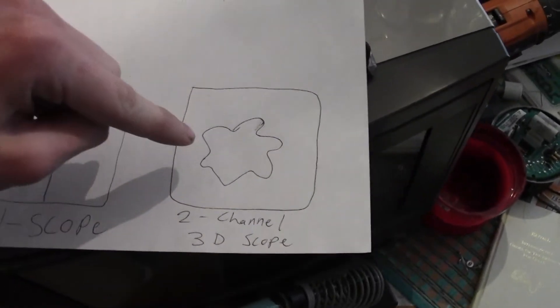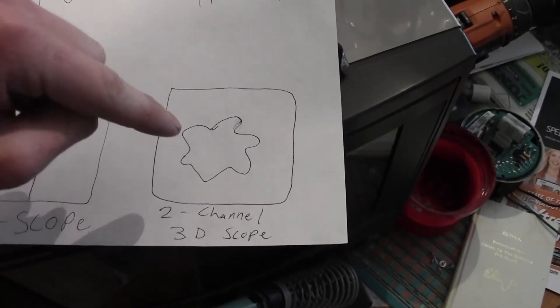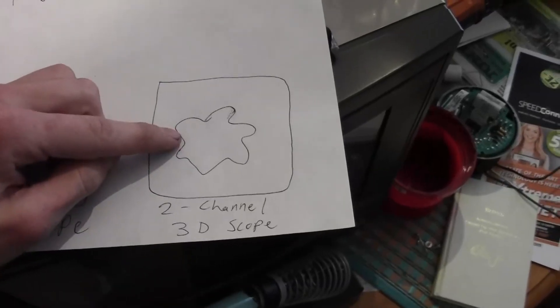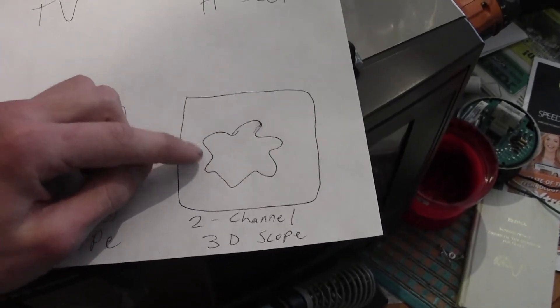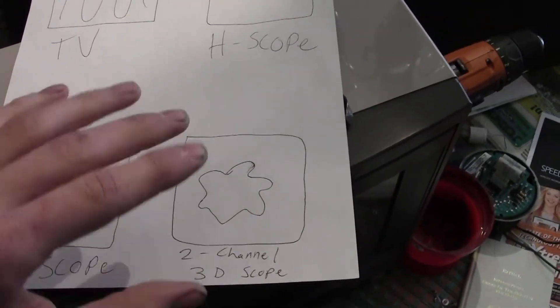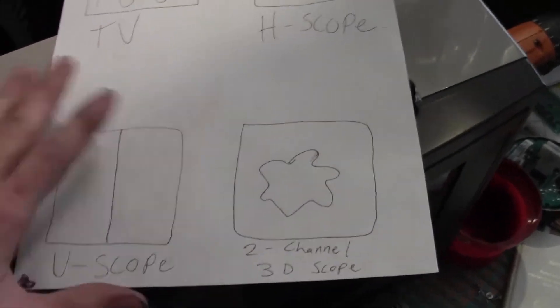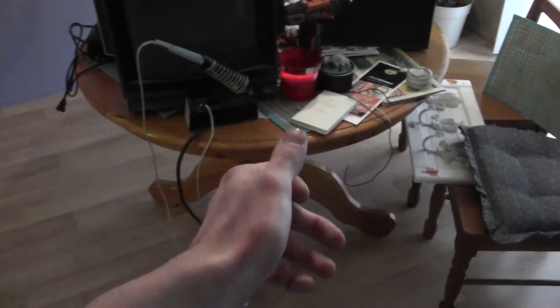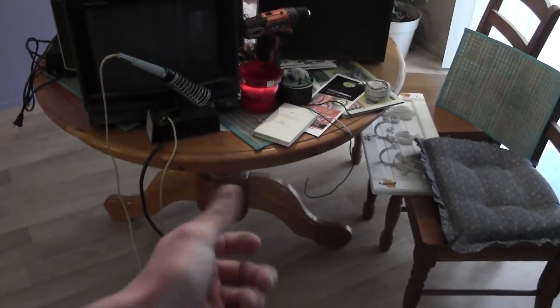When the 3D function has no input, there will just be a dot on the screen. This is the oscilloscope function you'll use for oscilloscope music. It's important to remember that the vertical and horizontal coils of this television have different impedances, so if you hook this TV up to an amplifier, you'll need to adjust the left and right balance to get the screen looking correct.